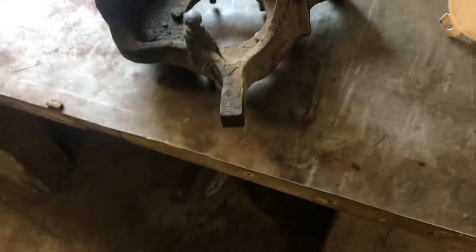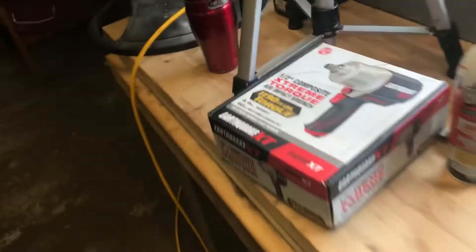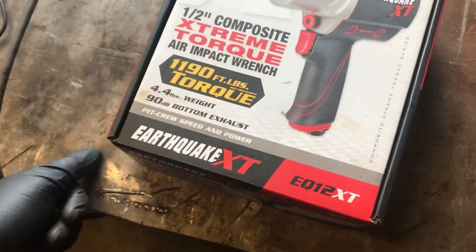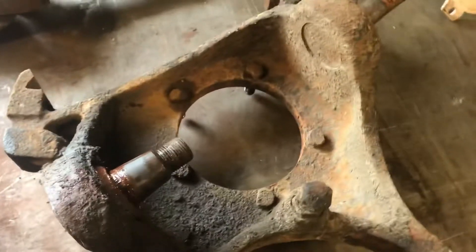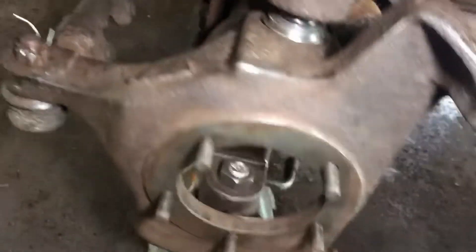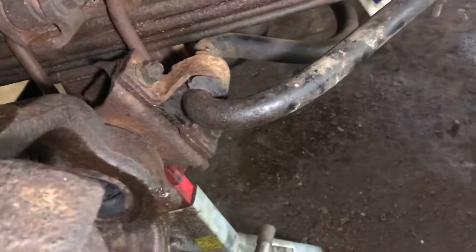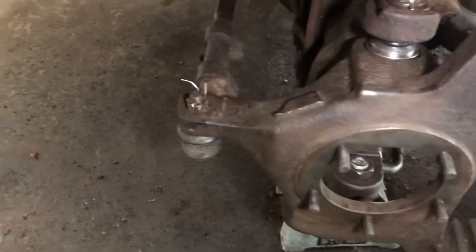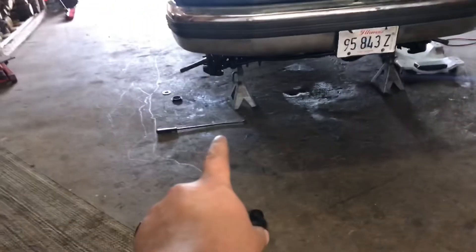Let's try and press these out — try out my new impact too, since I can't really get on anything with a breaker bar. We're going to see if this isn't going to be enough foot-pounds to bust these out. Ball joints are in, both sides. I got new seals put into the front, took the carrier out, re-sealed the inner axle, and cleaned everything up. I got a rag in there because I'm going to paint everything next. New ball joints. I got the stub shafts in right now, so the next part to go on would be the dust covers.